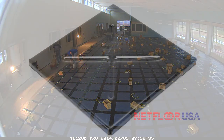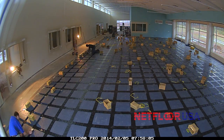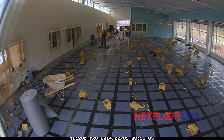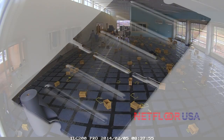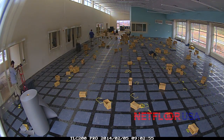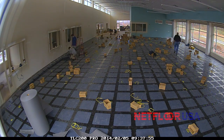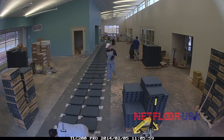The next component is the central cap. This is a high-strength piece of steel that covers the cable raceway. Specifically, it goes at the intersection of four access floor panels and works in conjunction with a flank cap, which also covers the raceway. Here is a picture of a flank cap. As you look out across this room, that black grid you see is the cable raceway grid. If you have any concerns over how many cables or wires can fit in your access floor, looking at this grid should ease all of your concerns, because there is an enormous cable management capability with this floor.